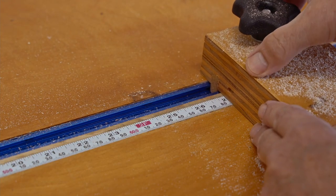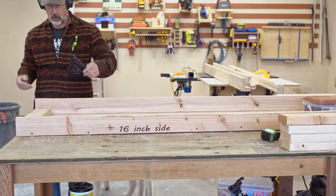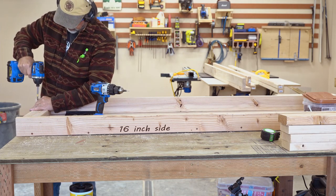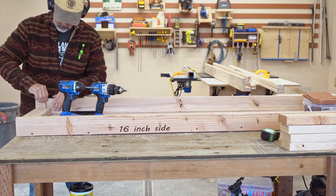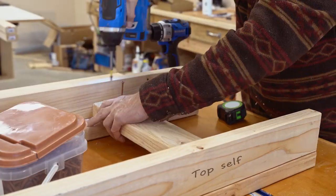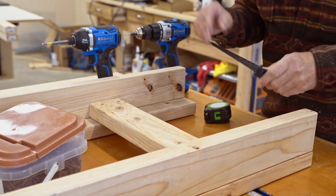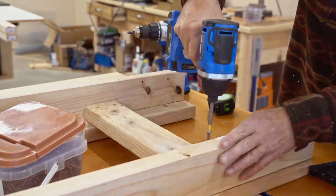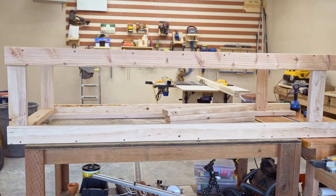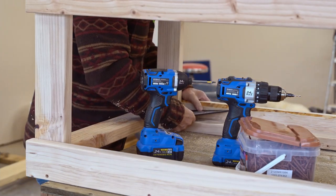For the long side, I'm going to cut these at 27 inches. For the depth, I'm using 16 inches since those are just the cutoffs I have from the 2x4s I just used. Making sure everything's square — the top is down about 8 inches or so. Once that's on, I'll flip it over and put the 27-inch sides on, again making sure everything's square.